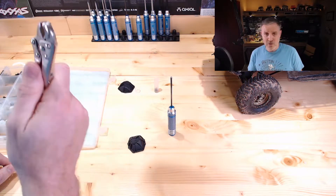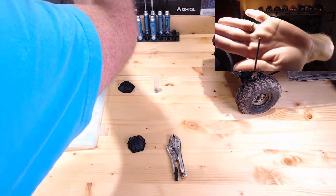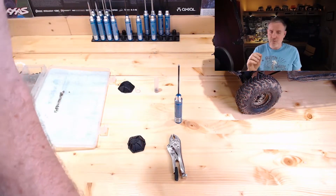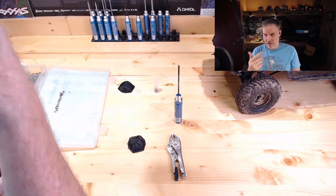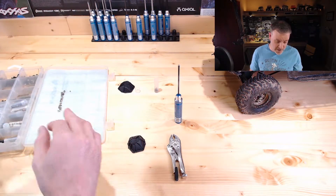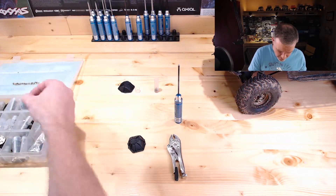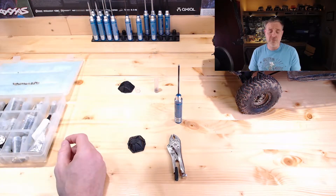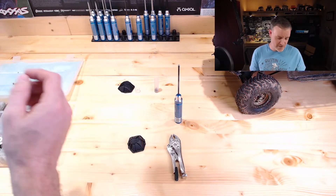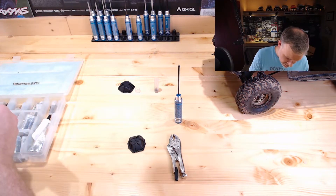With our M2x1 hardware, because this stuff is so short — it's one millimeter long — because of the cutting process used to make these, sometimes the first revolution of thread kind of folds in on itself. What I always recommend is to take the screw and first thread it into an M2 nut — a steel nut — because that will reform that first thread. We do have gift cards; I think we call them gift certificates in the store.